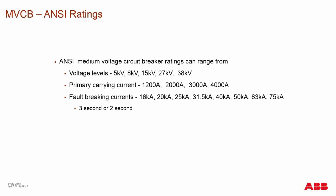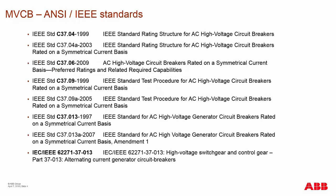As that said, the switchgear has always had a 2-second rating, so the 3-second rating on the breaker was not really required since the system as a whole could only handle 2 seconds. The ANSI standards — referring to the IEEE standards — include C37.04, C37.06, C37.09, and C37.013.